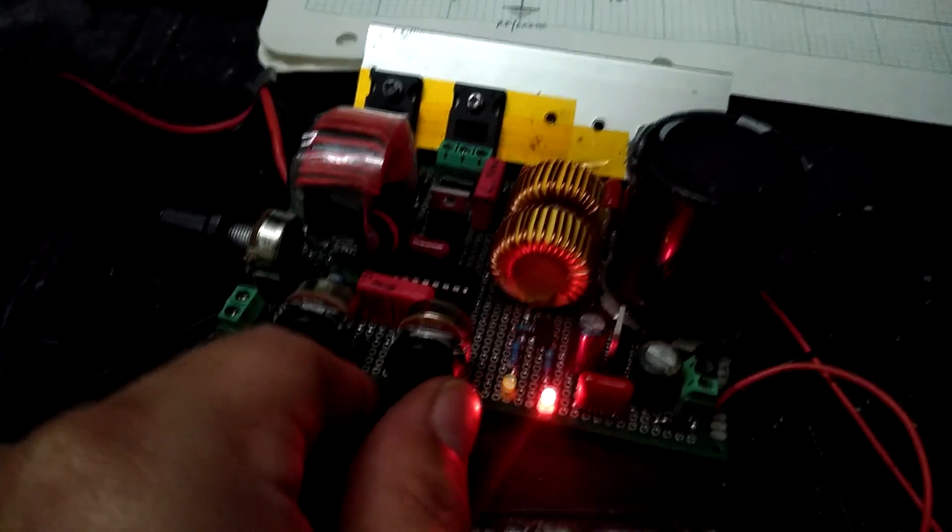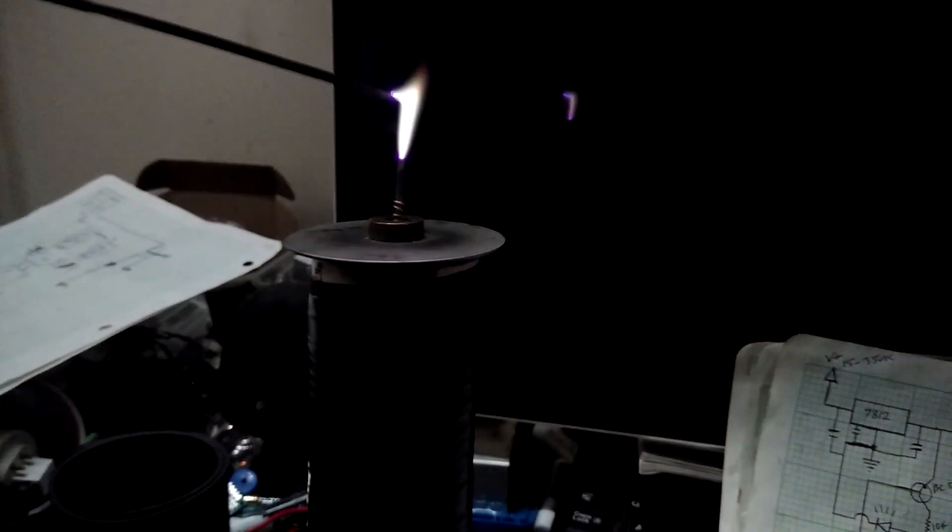I've got this going at about 13 volts — that's about as low as I can go with the way the voltage divider is set. I'll put it continuous, all the way up, and you can see it pulls a couple of amps. With the primary sitting where it's at — not all the way at the bottom — I don't really get any plasma output at that voltage. If I drop it down it'll give out a nice little bush of plasma, and I can draw it out by loading it.